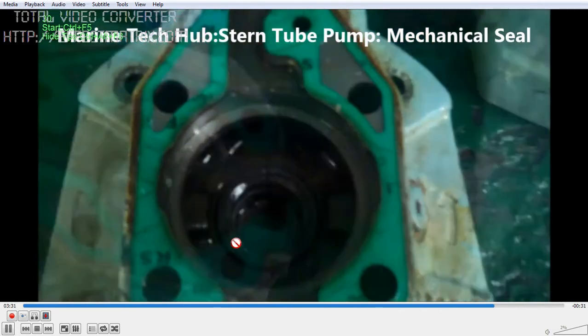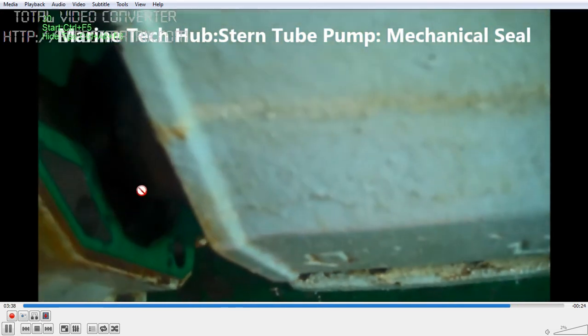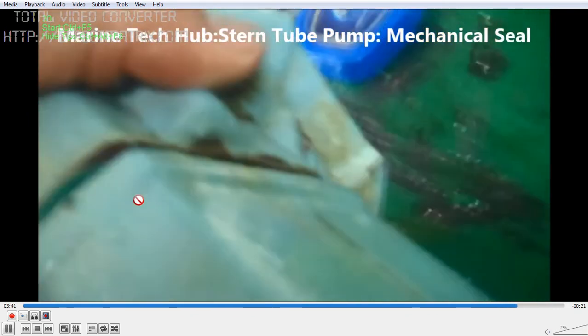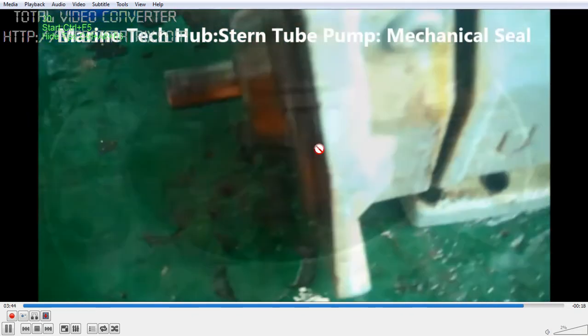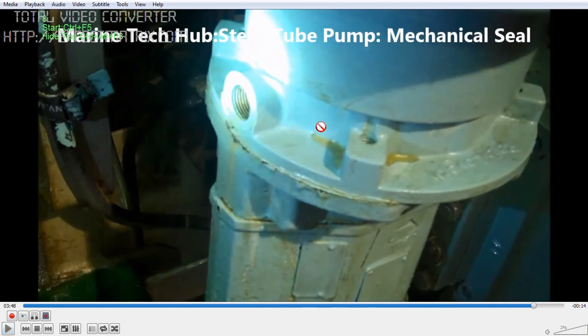You can see the surface here very nicely. Now I am assembling the top cover. Once you assemble the top cover, make sure the sealing arrangement is okay — there is a seal that should not get damaged. If you have any doubt regarding that, let me know. Once you assemble it and start running the pump, if there is a leakage, this is the tell-tale hole here. If the mechanical seal is leaking, the oil will leak from here. Make sure the mechanical seal is in the correct position and the seals are in place. Thank you.